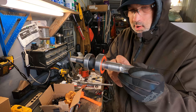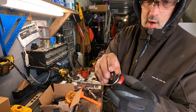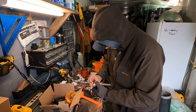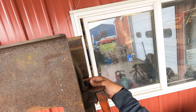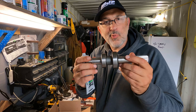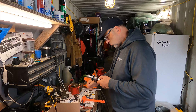Here's that old shaft and bearing — you can see it's got this gasket loaded on there, that's just the way it came apart. The new shaft components don't come pre-loaded, but when I open up the bag for this seal that goes in there, it's loaded right there on a little cardboard insert. This water seal — oil seal, whatever — has to get mounted in the housing. Got her in there with the press, looks really good.